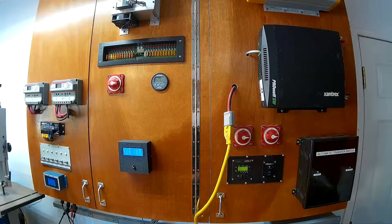After four years of being in service, my battery bank has finally died. It has almost no capacity left even though it shows that it's fully charged and I've got 13.3 volts right now. As soon as I put a heavy load on it, the voltage drops significantly. So it's time to swap it out.